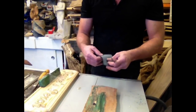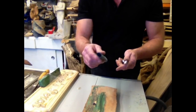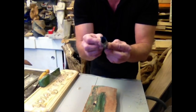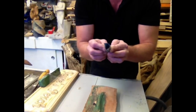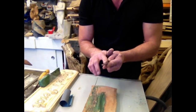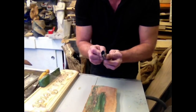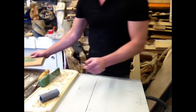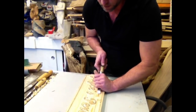Now for the inside, I don't have slipstones. What I use is 2,000 to 3,000 grit wet-dry paper, rolled into a little tube. I force the tube to match the inside and just give it a few rubs, because as I'm stropping it one way I'm building up a lip, so the sandpaper pushes that lip back the other way. A little quick rub — that feels very nice. That's what, two minutes? And I am ready to go again.